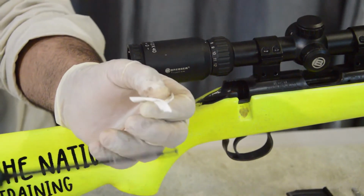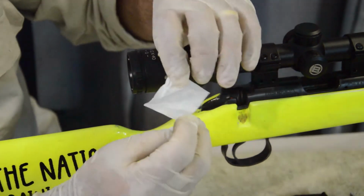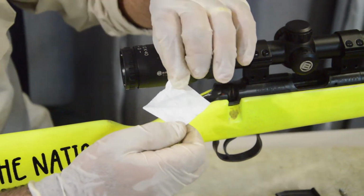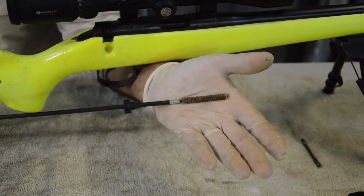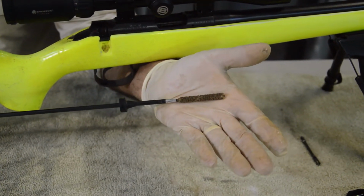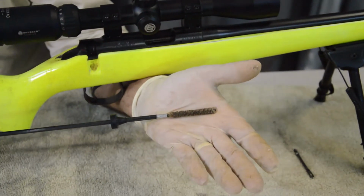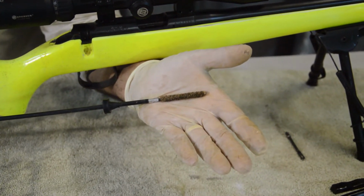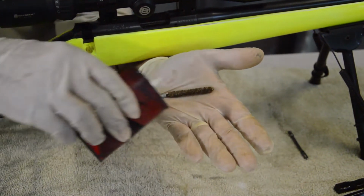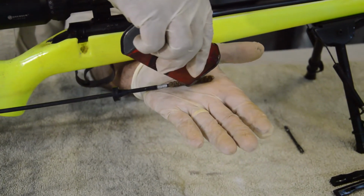I've gone through now about 6 times. That's as clean as I can get it. The rag's quite clean. I'm happy with that. So after all our cloth rags up the bore, we've got it clean. Now we'll put the oily mop up it to put a nice film of oil up the bore to protect the rifling.